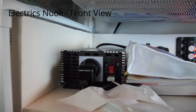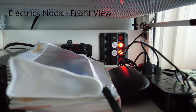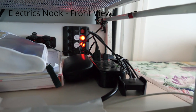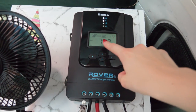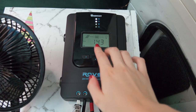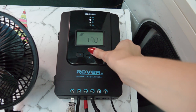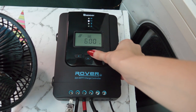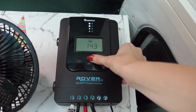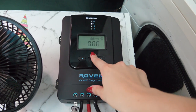This is a 1000W inverter, and that allows me to use my sandwich press, charge my very power-hungry laptop, and I also have a bunch of USB outlets on here, which don't really need the inverter but it's just convenient. Here's my charge controller — on the home screen I can see that the battery is at 14.3V, which means it's full. It's only on boost charging at the moment, basically just topping up what the fridge is drawing. I'm getting 17V off the panels, 6A, battery's at 100%, voltage is 14.3, and nothing coming out of the load since everything's coming straight off the battery.